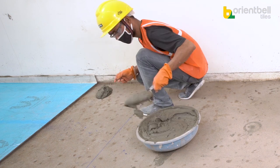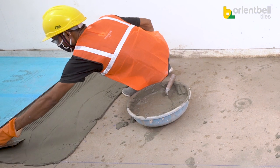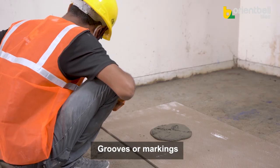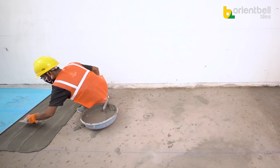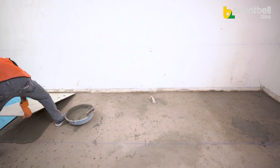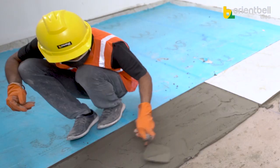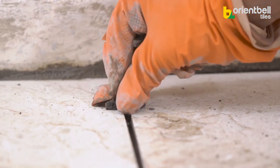Keep the adhesive on a clean tray and apply it on a clean floor according to the markings. Make grooves on the applied adhesive on the floor. The back side of the tile should be cleaned, and also make grooves on the back side of the tile after applying adhesive. Keep in mind that the grooves should be horizontal on the floor and vertical on the tiles. Note the direction of the arrows and install all tiles, striking with a rubber mallet to fix firmly. Check levels and alignments, and always use spacers.